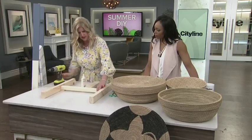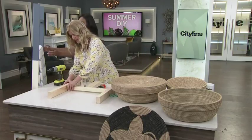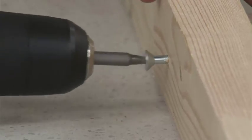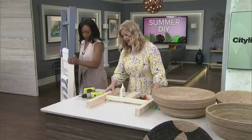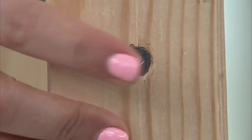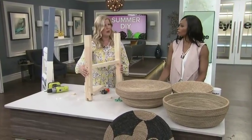Make sure you're using wood screws. I love using power tools! I countersink the screw all the way in, and then you're going to fill that space with wood filler, so you don't have those screws lining the whole ladder all the way down — because it doesn't look quite as finished that way.